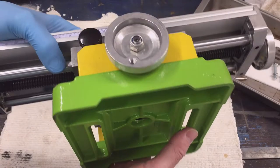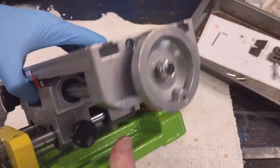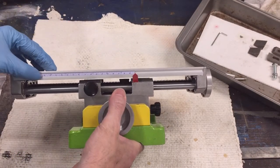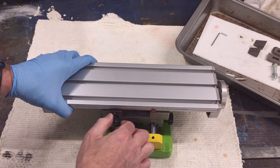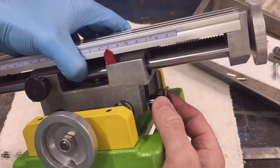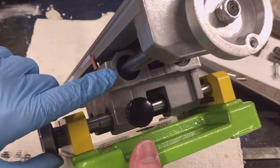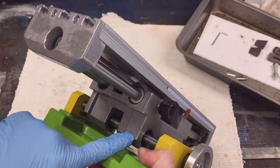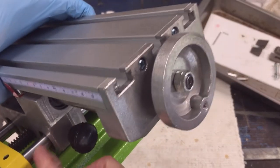Just a quick look around this little slide table. I like the heavy base — I like this cast iron base. My first impression is that I really like it. For $100, I really like the linear bearings and the precision guide rods. The scale is adjustable and it's graduated in inches on the top and metric on the bottom. I believe these little thumb knobs are for setting the guide play. If that's just a little bolt that goes through and hits the precision rod, I don't think that's a good way to do it — it'll score the rod over time. I do like these linear bearings; there are four of them on each axis and they seem pretty deep, which should be very good for keeping the work table stable.